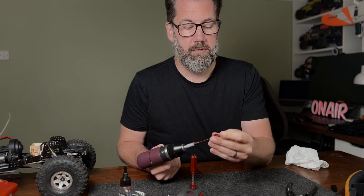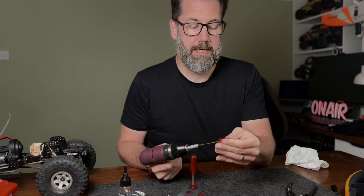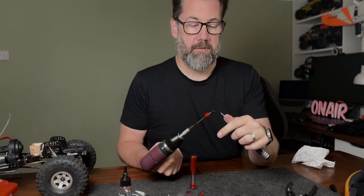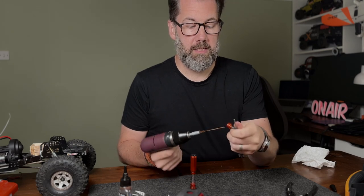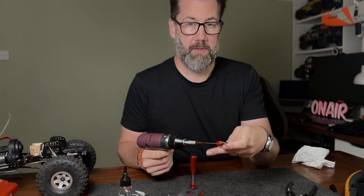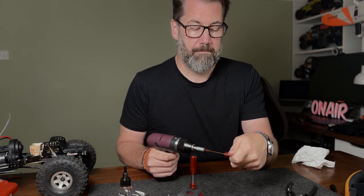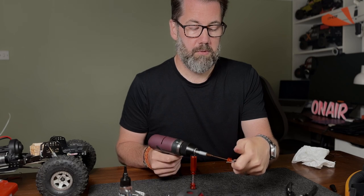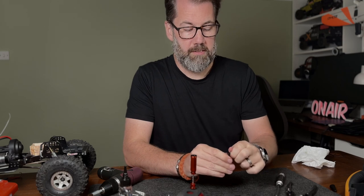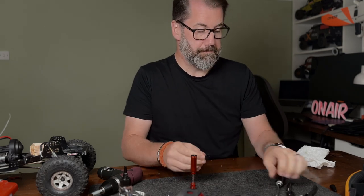And what that will do is that will just suck that rod end down into the cap as it goes along. Now you might see that it shaves off a little bit of that hex plastic as it goes in, that's fine. And then I tend to just put a driver through it to give it that extra bit of torque, so I can torque that down. Obviously don't over tighten that. You've got to be really careful not to over tighten that and strip out the threads.